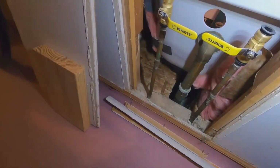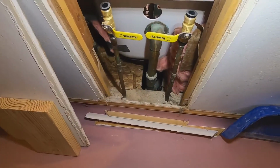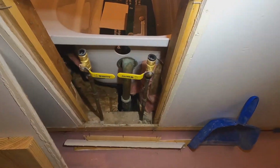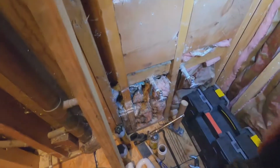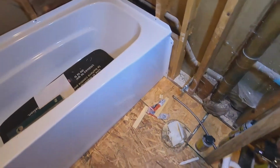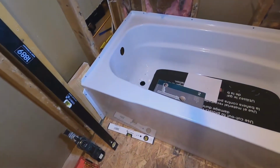You'll see here on the back, it's kind of just become standard now that all these shutoff valves on the supply lines, if there's even shutoff valves there, they're usually so rusted and corroded that they need replaced. So I did that first thing so that I could chop all that out when I was doing the demo, but went ahead and put new shutoffs there. And here on the faucet supply lines and the toilet water supply there. So it's pretty much just become standard that those are gonna need replaced. So I just keep those on hand so that I have them when I do all that.